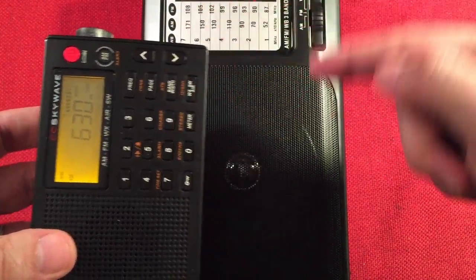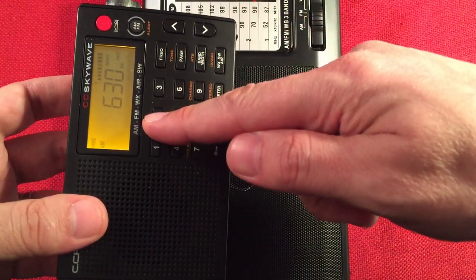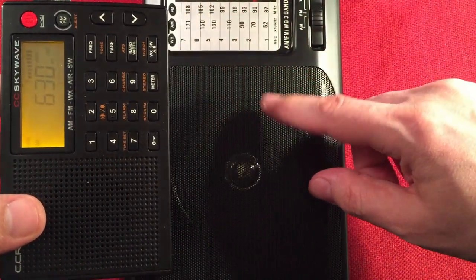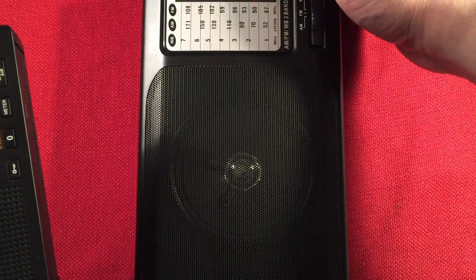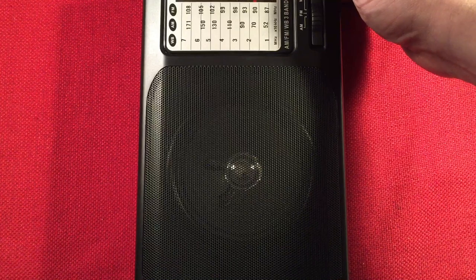Okay, so the thing about this radio, some of these DSPs, they bounce back and forth as you tune it. It went backwards from 640 to 630. We're listening to, I believe, if it's, let's see. Really sounds like KYFI, St. Louis, Missouri, 275 miles, 5,000 watts, a religious station. There's a country music station on 630 also, CFCO in Chatham, Ontario. Okay.